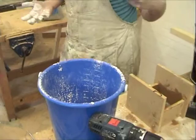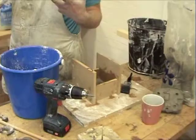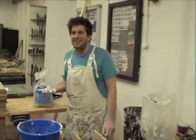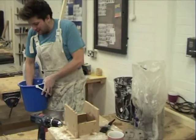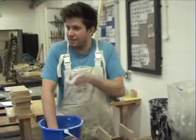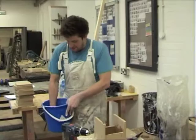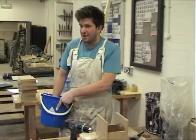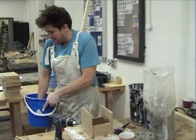You can get away with mixing it straight away. The actual drying time and the way it soaks up is just how rigid it's going to actually set. How long it takes to set depends on how long you stir it for — the more you agitate it, the quicker it's going to set. If you're mixing large amounts of plaster, there's an attachment for a drill to do it electronically. But when it's this size, you just do it with your hands. The longer you soak it, probably up to about 10 minutes, the better for the whole process.